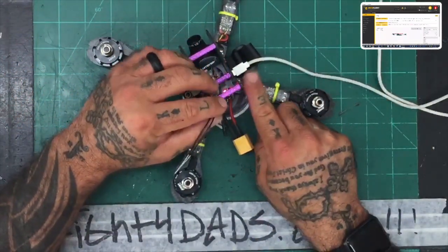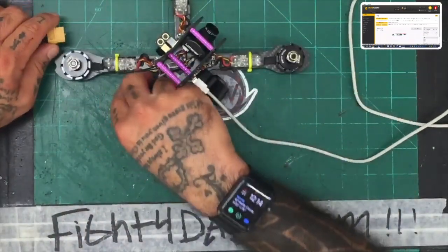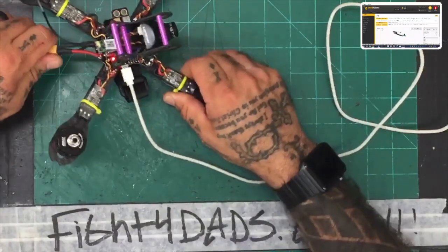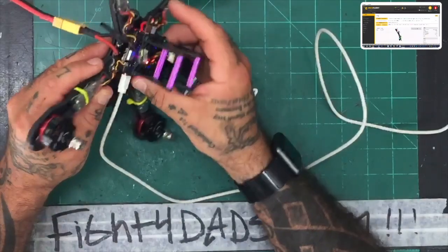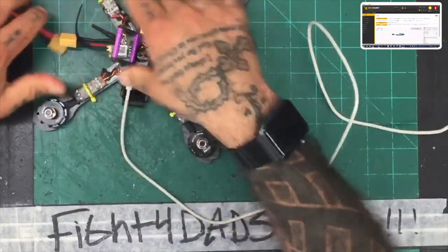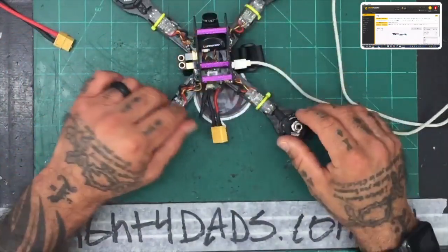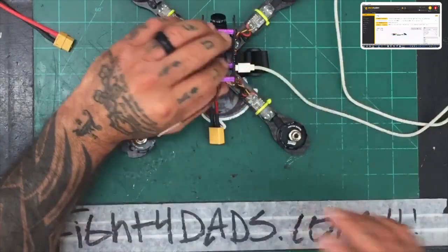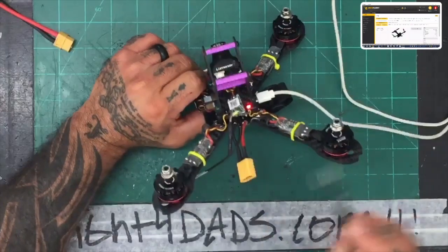You will see the number light up when it's off if you have the USB in — don't worry about that. That's the readout of the channel you're on. When you plug in the lipo, the VTX is now off. Make sure the switch is pushed towards the front of the board — away from the lipo pads — and that will turn the VTX off. So if you want to work on the board while you have power or while you're updating your ESCs, the VTX doesn't have to get hot.